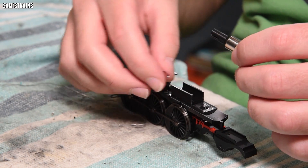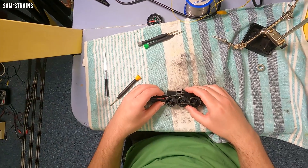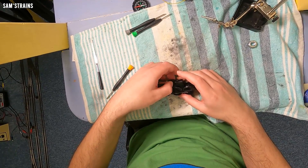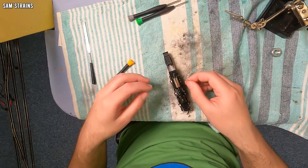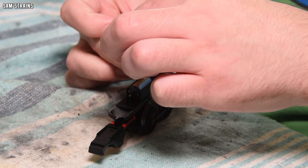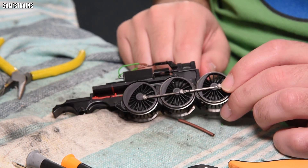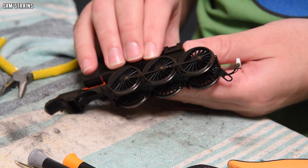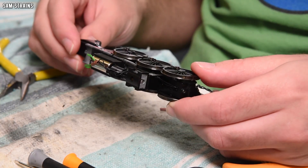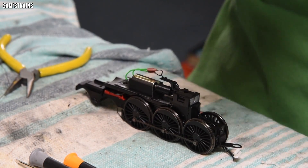Now I've got to get the adapter that interfaces with the drive shaft of the loco onto the motor. I'll check the distances and push it on as far as I can using the vice. The motor shafts don't appear to be bent and everything seems to be rotating well. Can I just snap this in and that will be that? The height looks right. The wires aren't quite long enough to reach the motor so I'm going to have to extend them a little bit. Okay, new wiring done — all insulated and the wires are routed out of the way.